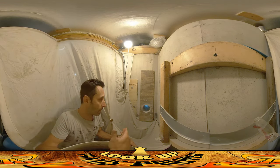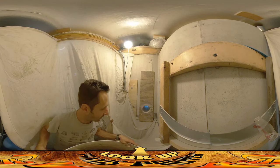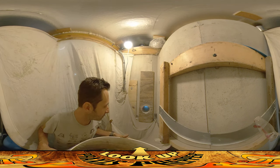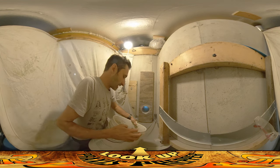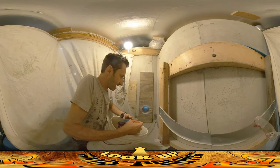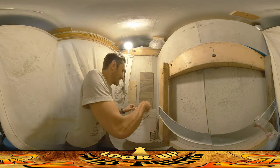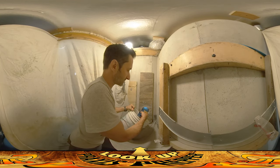It's kind of hard to get cement in and around that, so I'm going to do the best I can. One thing you can do if you want new concrete to bond to old concrete is make sure the old concrete is moist, so it's not sucking all the moisture out of your new concrete, because the new concrete needs wetness to cure. Concrete does not dry — it cures — and for that chemical process to happen it needs to be wet.